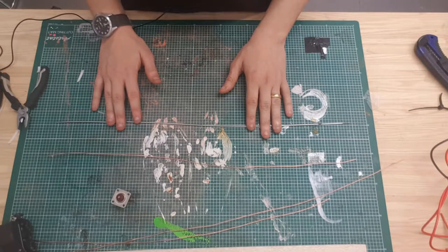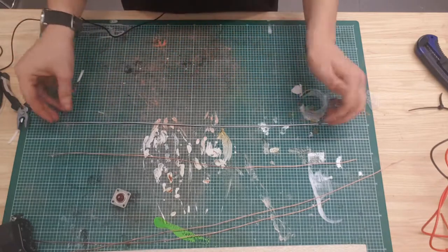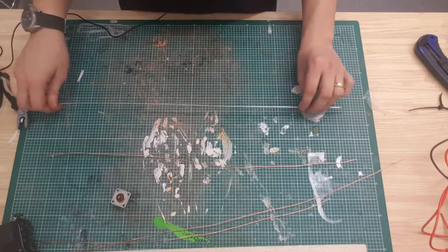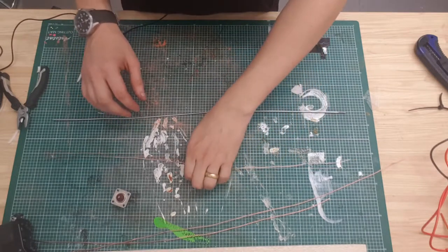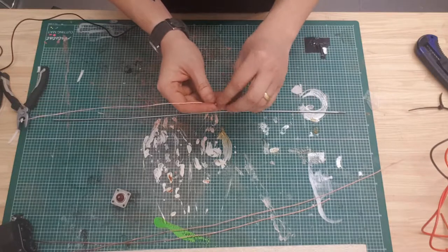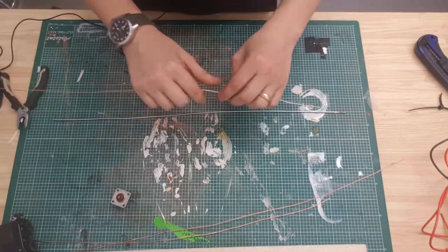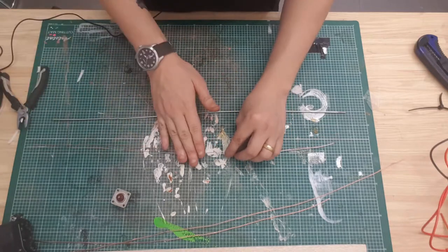I'm talking low frequency, so there are differences, but I have seen radials which are copper and the antenna is very thick aluminium, but that's low frequency. That's a different ball game, so it might be different. I don't know. If you want, you can make this entirely out of copper, and I would recommend that if you're going to use it in any way, shape, or form. If you make it entirely out of copper and you do your measurements correctly, you probably won't need an SWR reading. As long as you've done your calculations and you've measured them out, you'll be fine.